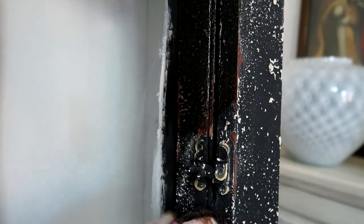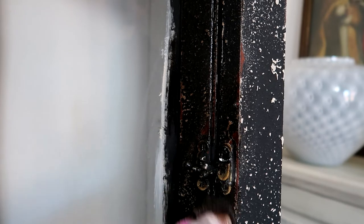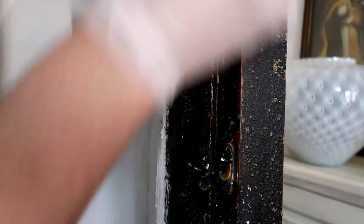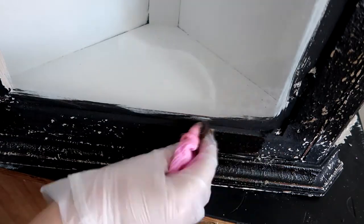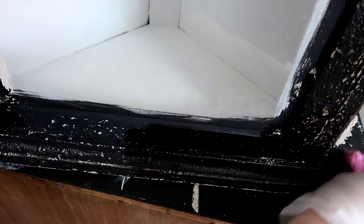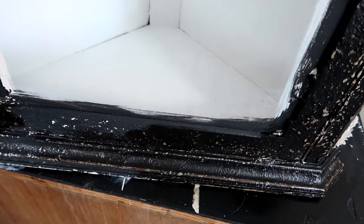In this case I'm using my own top-secret glaze and just applying it over the piece. Those white flecks take on an instant aged appearance and the dark black really enriches and looks like an antique ebonized finish. The glaze also acts as a sealer and top coat so once this dries it's done. This glaze is one of the products I'm looking to include in a new range of paints and finishes, so if that's something you'd be interested in let me know in the comments. Subscribe to my channel to see updates on that and see me experiment with my own paint range.